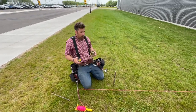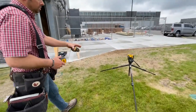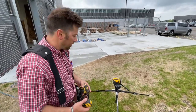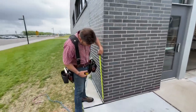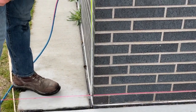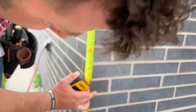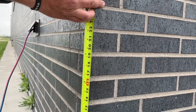We've done a little reset for the sake of learning — we moved our self-leveling laser over onto a tripod. Any time we move the laser, we have to redetermine our zero height or what our height off the building is. It's not going to be 23 and a quarter. Remember, we're pulling off of a given height here — off the top of this bed joint. It reads 20 and a half, so that's our new magic number.